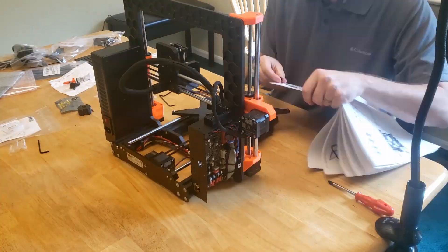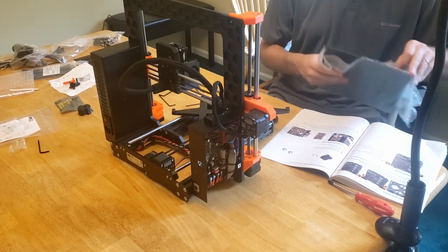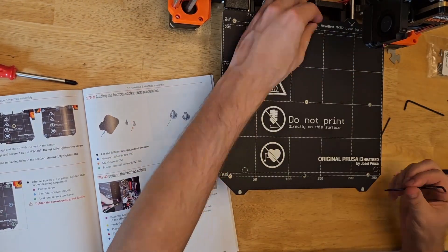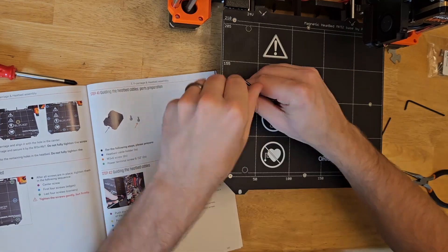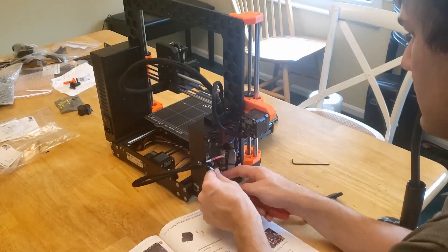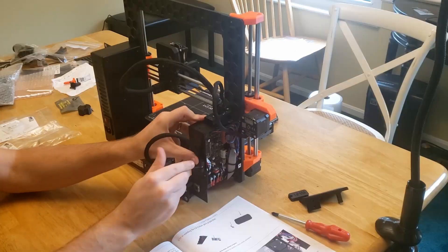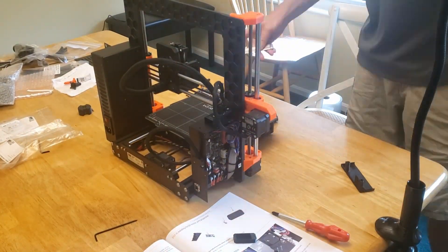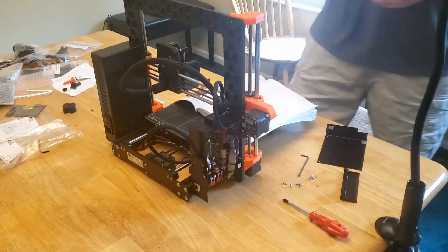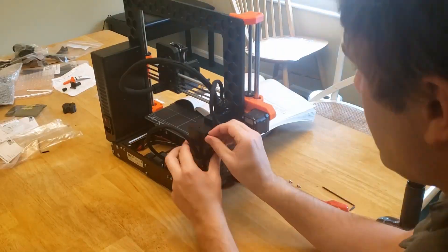From here we start getting the heater plate ready, beginning with adding the expansion joints, then a spacer, followed by the heater plate itself which just gets screwed on. You start with the center screw loosely, then go in a diagonal pattern around the outside, and then go back and tighten all of them up. Now onto the wiring: the braided cable gets fed into the buddy box and a cover clamps into place. We screw in a few cables and confirm everything fits. The MK4 comes with a WiFi adapter this time, so we hook that up now — apparently it's pretty slow, but it's better than nothing. A bottom cover goes on, then a side cover, and the buddy box is all closed up.